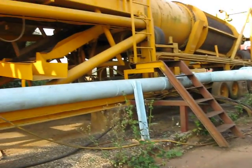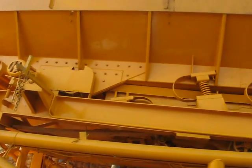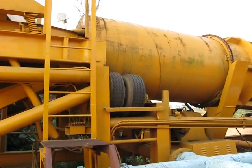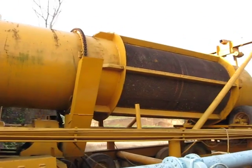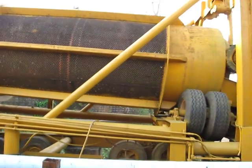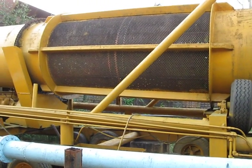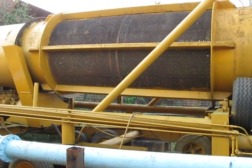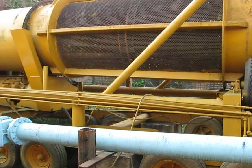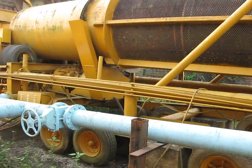The original wash plant comes from here, which is the upper part, and it goes down to the trommel over here, and this is the whole place where the wash plant really originally was supposed to finish. This is for 150 yards. This place where it's holes over here, this is where it separates the stones and the gold, the size, and it's supposed to come out over here a sluice box. Our machine goes much further than that.